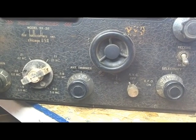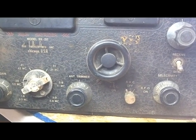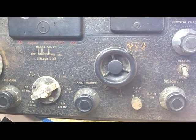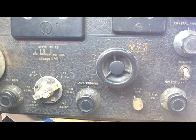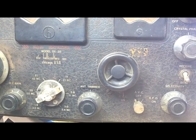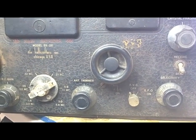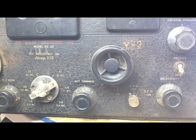A lot of other radios like this, I've been able to take like 1,000 grade sandpaper and sand off the excess, just leave the part inside of the engraving, and then hopefully I can do that and not sand off that base finish. It's a bluish black from what I've been reading, and even if I dull that base finish, maybe I could spray some clear on it after that, semi-gloss or kind of a dull looking clear, so it doesn't shine so much. So we're gonna have to do that.